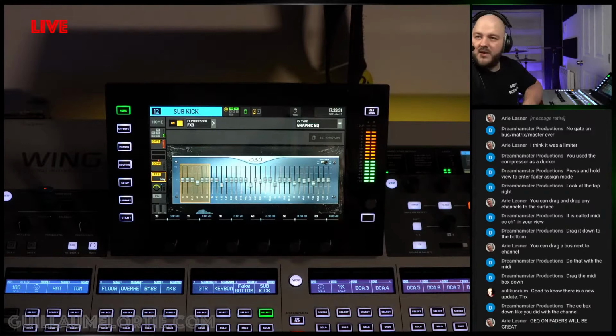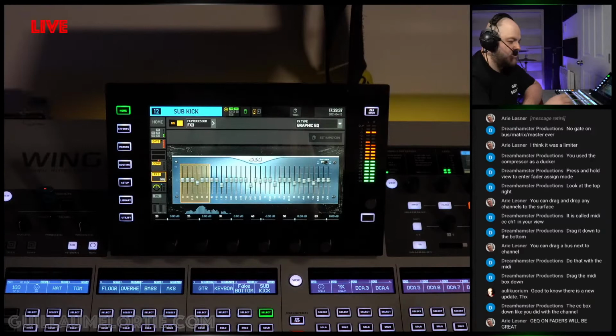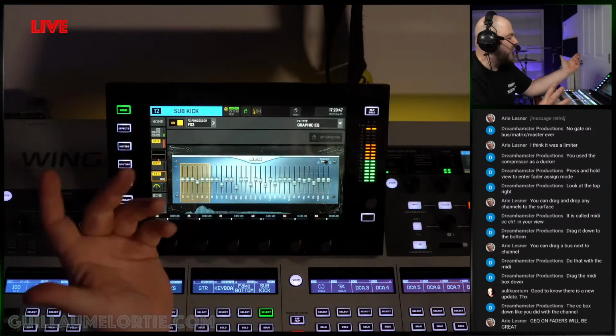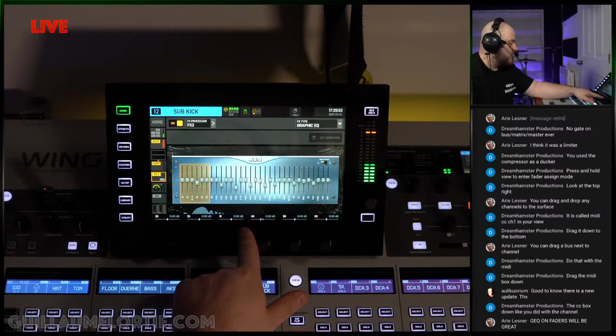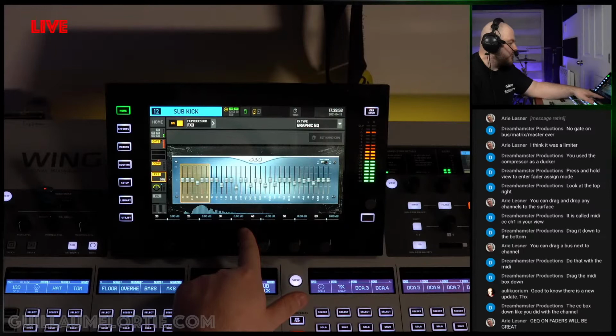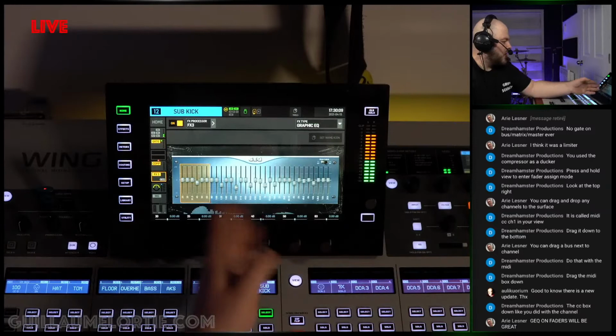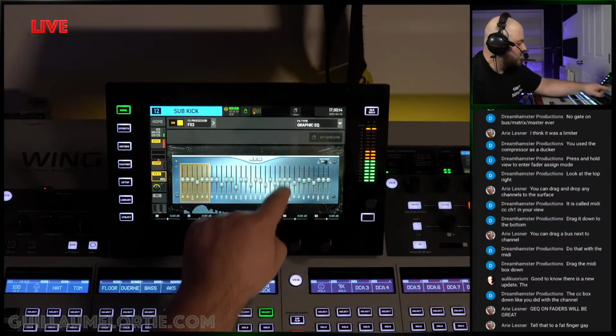It will be faster for me to just scroll around mixes and, let's say, just do some user knobs to have my EQ popping up on mixes, doing monitor, and just grab the fader. It will be as fast as analog. And we have the RTA in the bottom. So for some people who don't know their frequencies right away when they start to feed back, you have a visual reference in the bottom. Yeah, GEQ could be fun on fader, but I would rather have all my 31 bands in front of me and just grab something that's feeding back on monitor.